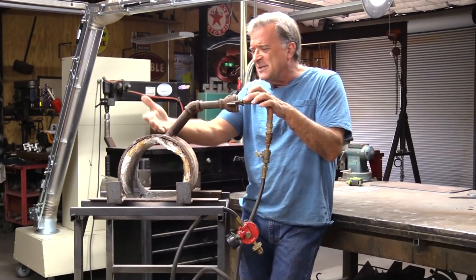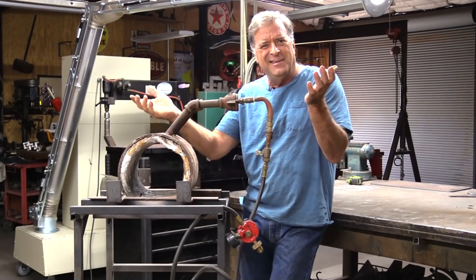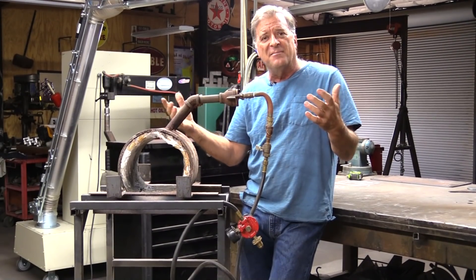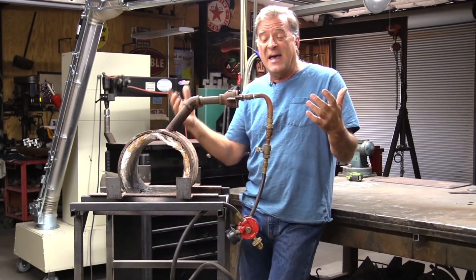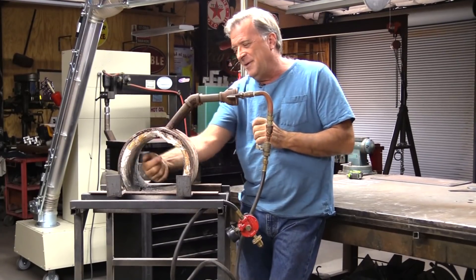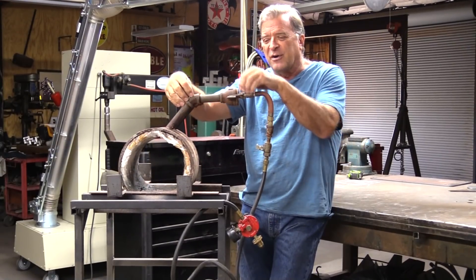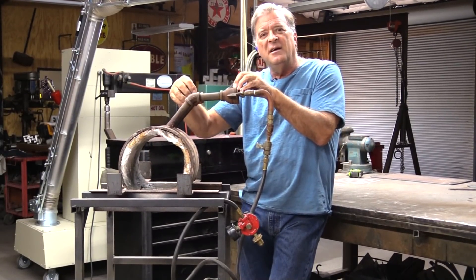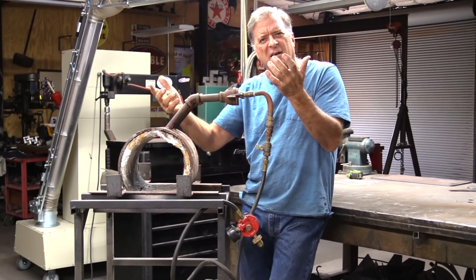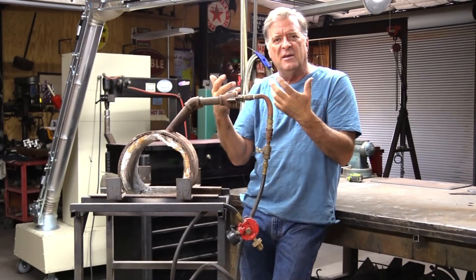It's got to be somewhere between here and there. But from here to here, this is just pipe — several pieces of pipe and fittings. They're not going to break; they're steel. So put it together and fire it up. Now I have a nice bright blue flame coming out of this nozzle, this burner right here — but on this one over here, it's kind of yellow. It's not very big. It's not working right. And if you stand back on this side, you can smell raw propane.